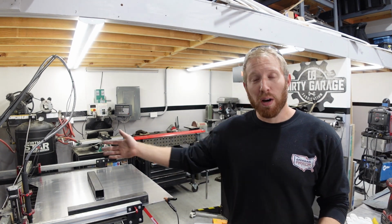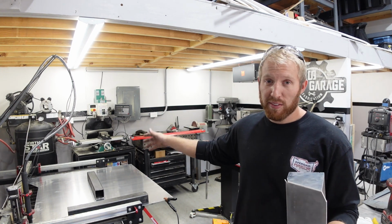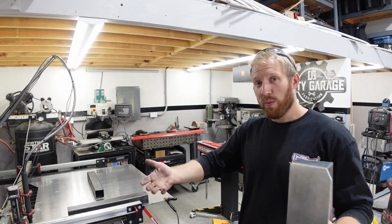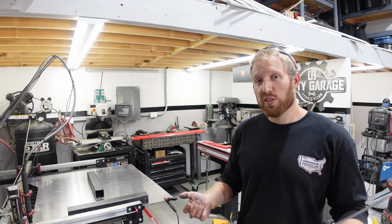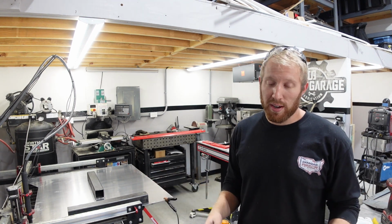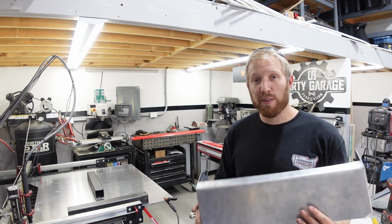So it bottomed out, essentially it crashed that stepper into the X-axis on that plane. Then once it continued on, it thought it had done all those steps, but it actually was completely off half an inch. So that's why everything kind of got really skewed after that.